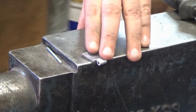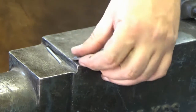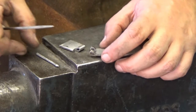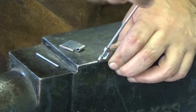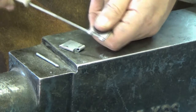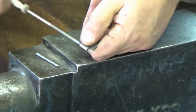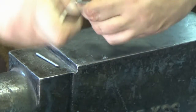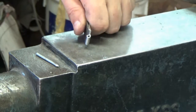There we go. Give the back a touch just to get rid of that burring. Happy days. So we've cleaned up all of our edges, and just before we go putting the nail in to finish it, get a needle file and just make sure there's no burrs or muck inside the piece. I've also given it a quick clean, just down to 120 grit. Whilst it's in bits, it's simpler to clean all the dirt and the muck out than it is when it's held together. But you're going to give it a polish when it's with the armour. That'll sort that out. So just cleaning around those points, make sure you get a nice clean fluid motion. Now what we're going to do is get the nail put into these, once I pick this bit up off the floor.